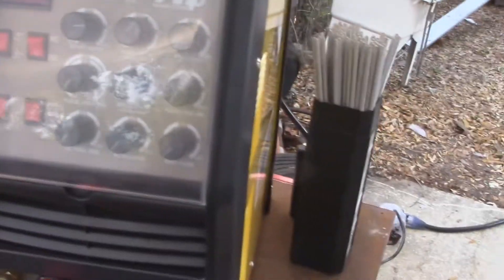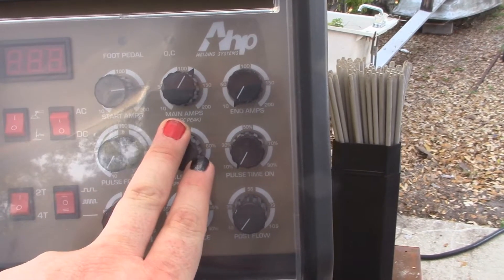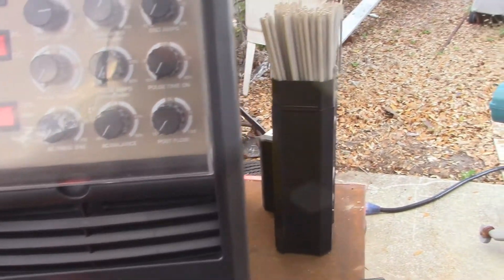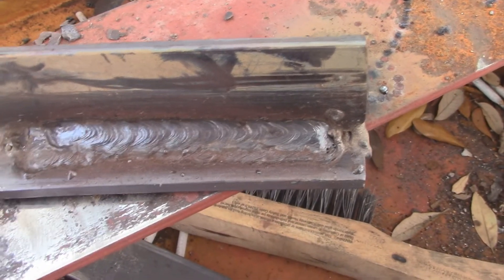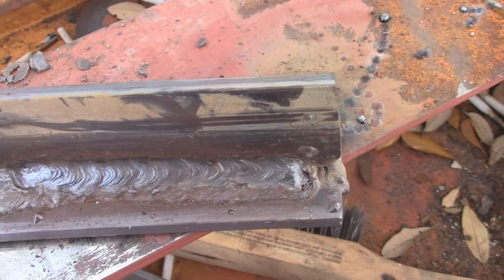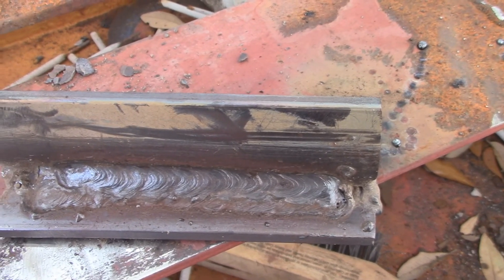Let me come around to the AlphaTIG so I can show you the settings I used. I've got my starting amps at 150 just to give it a little bit of a hot start, and then my main amps were at about 125. I was welding with 7018s, Electrode Positive. Like I said, it turned out really good - that's one of the best looking stick welds I've ever done in my life, in the short time I've been doing stick welding. I'm going to do a more in-depth video on this in the future, showing both me welding with the Stickmate as well as with the AlphaTIG. So yeah, I'm impressed. Thank you everyone for watching and we'll see you later. Love ya!